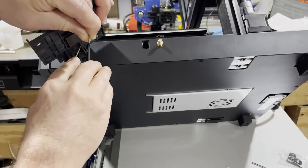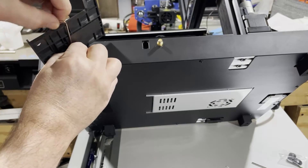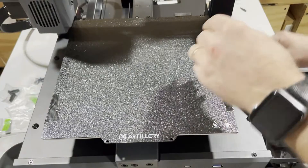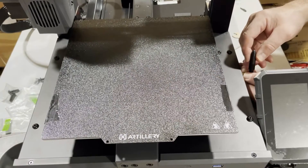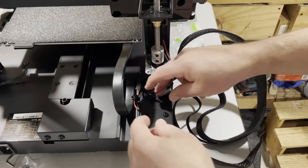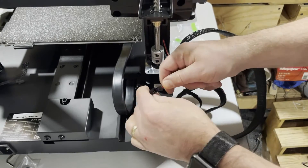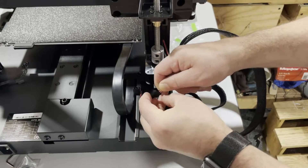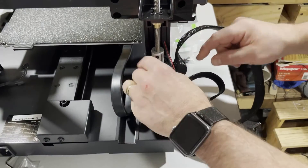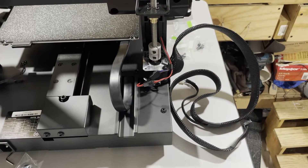This magnet makes it a bit more interesting — keeps grabbing your wrench as you try to tighten it — but still pretty easy. Here's where we connect the wire, and that snaps in vertically just like that. Next we attach the Wi-Fi connector right back here. Note the nut will turn without the Wi-Fi adapter moving. The LED light connector: check the adapters — this is a two-pin and that is a three-pin, so it's not the correct one. The two-pin is correct, and that snaps in easy. It has an up arrow so it's easy to find and connect.